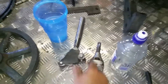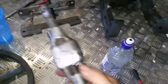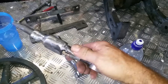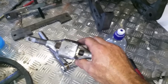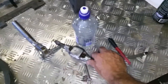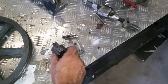So what I did was make a tensioning handle — overkill, but I just machined something up and cut up some 20mm flat steel. I also got a big 16mm turnbuckle. It was very long — I could have used the 12mm, but I just cut it up and shortened it. To join the two halves, I grabbed a piece of hollow 50mm by 3mm tubing and crushed it in the press to make it oval until the ends would slide in, then welded everything up. It mounts so that it pivots at each end — I machined an eyelet on that side which goes in there — and then this assembly mounts in these slots.